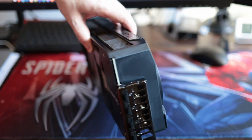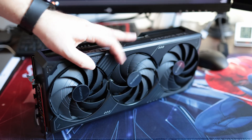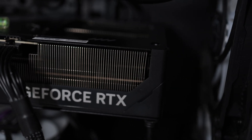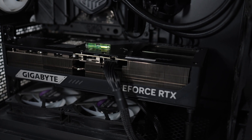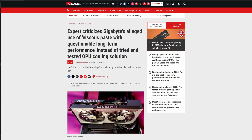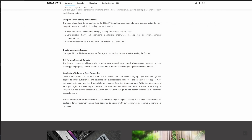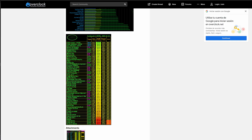Looks are subjective so what I like may not be to your liking. The only thing that makes this GPU look really cheap is the fact that the bracket is for 2 slots while the GPU is around 3.5 slots. There were GPUs from Gigabyte that had thermal putty leaking issues but those are reportedly resolved — make sure you're buying a GPU with a serial number that starts with at least 2520, as around May 2025 Gigabyte stated they fixed the issue. Thermal putty is in theory superior to traditional thermal pads.